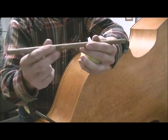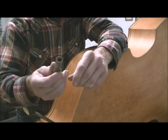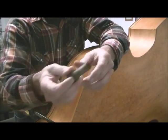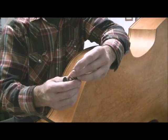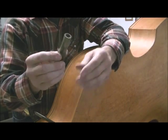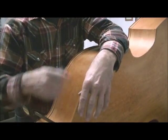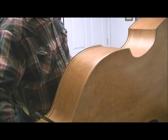So I'm going to go into my metal shop and turn down a piece of metal that will fit this ferrule exactly. The only other problem is that the hole this goes in is all wallered out — this thing just falls in and out literally. So I'll probably have to fill the hole back in and then re-drill it to match exactly, glue this in, and have a metal peg. It'll be much more sturdy and it'll keep that end from breaking any further, because all that play is causing that end to bust.